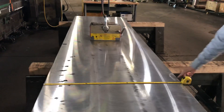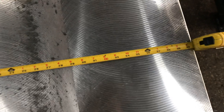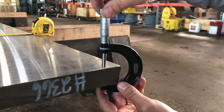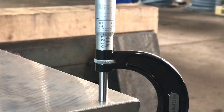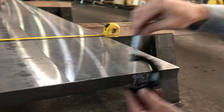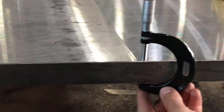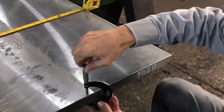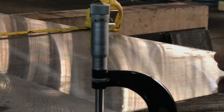Here we have a 40 and a half inch wide plate of D2. I'm going to start micing from the end. This end here we are one inch, three hundred and thirty-seven thousandths. Coming in here before the milled step, one inch, three hundred and thirty-five, and once I go across to where the milling cutter is moved over, that's about one inch, three hundred and thirty-one thousandths, going across before the step.